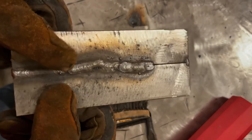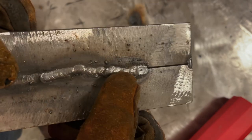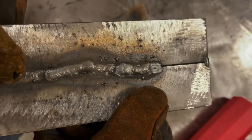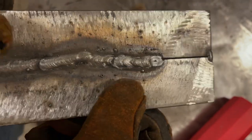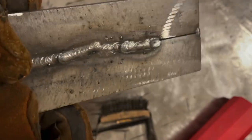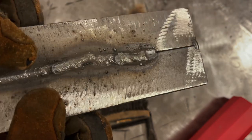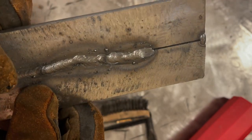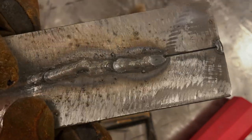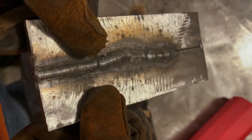All right, again, so I was welding right on the crack. It was going okay, and within, I'd say, a quarter of an inch, I started to get what appeared to be arc blow again, where big buckshot started coming out of it. I really think it's probably just too much amperage maybe, which I know sounds a little bit ridiculous, but this rod, 6013, isn't really known to be a high penetrating rod, nor is it meant to deposit a lot of metal.